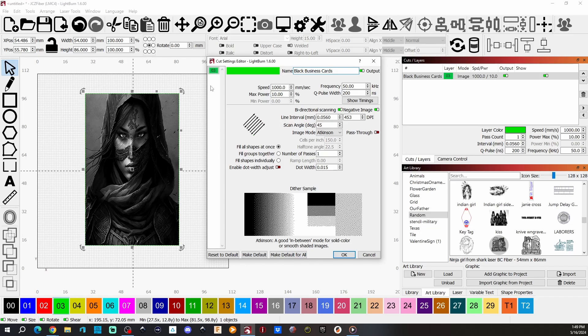I'm on my green layer and I'm calling it 'black business cards.' That way I'll just save it, so whenever I want to do a black business card I pull up the green layer and drop a picture in. These might not be exact settings — they may not be perfect — but they're working pretty well. Even if two people have the identical same fiber laser working with the same file and material, their results will vary. That's why a lot of people don't recommend settings. These settings may not work for you, but if you're new to fiber lasers — possibly with a Houtian 60-watt JPT Mopa fiber laser like I have, using my smallest lens — these settings might get you a lot closer.